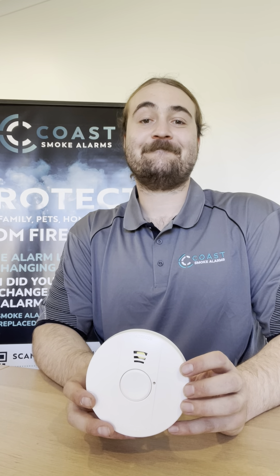This will put your smoke alarms into a 10 minute dormant mode. Step three, now we're going to vacuum all around the rim of this smoke alarm. And if possible, we want to vacuum around all your other smoke alarms in your property. Vacuuming will remove any bugs, dust or water vapours from within the smoke alarm. This procedure should stop the alarms from falsely sounding.